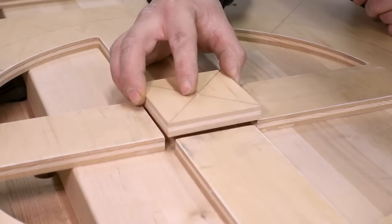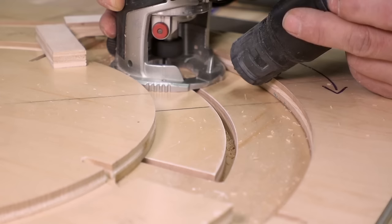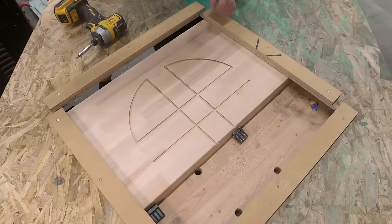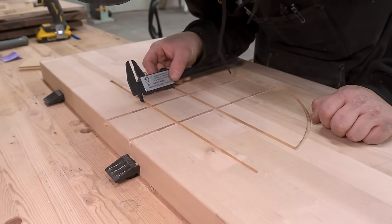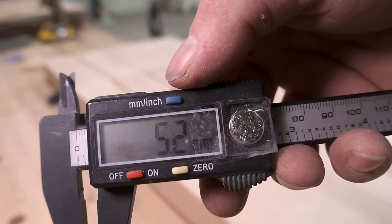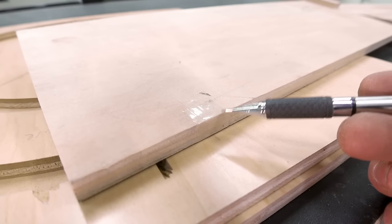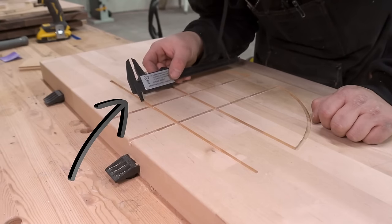The barrier serves as a way to not only place the jig where you want it, but pull the jig if you need to, test the fit of your inlay, then pull the barrier as long as you're 100% with the decisions you've made. I run a quick test on some maple to make sure all of my grooves are a consistent width — which they aren't. The smallest groove is 0.2 inches or 5.2 millimeters. So I just add some tape to various locations on the jig, which will micro-adjust the router and give me slightly smaller grooves to match the smallest one.